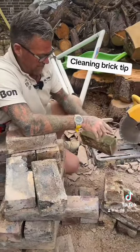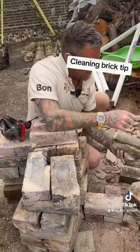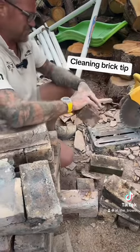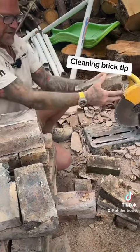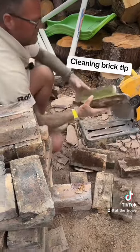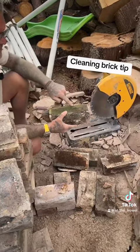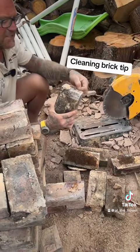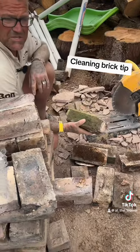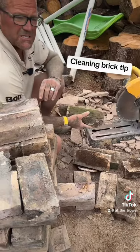So there's not a lot to take off that brick. What I would do — you've got to keep the face dead to the face — but cut into the brick at an angle. So when you lay your lime out, or if you redo them in sand and cement, you've got more underneath the brick which makes it much easier to lay.